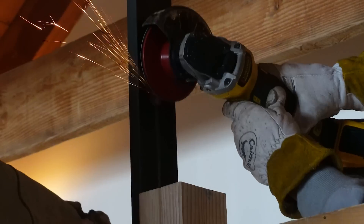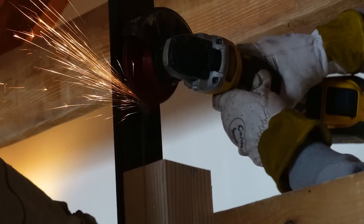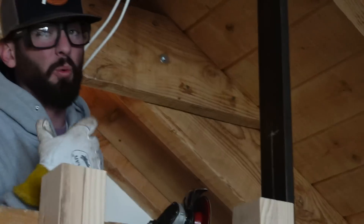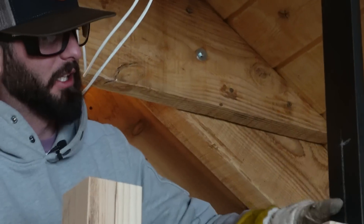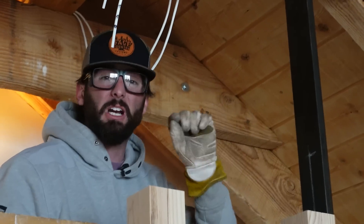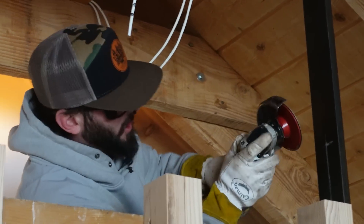This material had a little bit of wax and patina on the surface. When we go to TIG weld this, we want to avoid putting off a lot of heat and sparks, so we're going to clean this off because all that wax is just going to make that TIG weld spitter and pop and spit, and we're going to get porosity and all other kinds of problems.